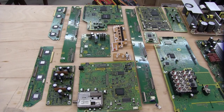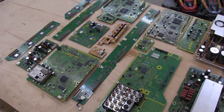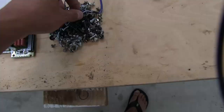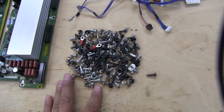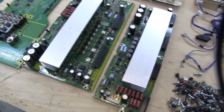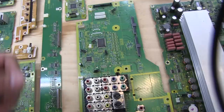I tried to get a good close-up of the edge of that small broken piece of panel. The top layer of glass is the rear of the display and the piece on the bottom is the front. You can see that small thin layer right in the middle — that is the phosphor cells, sandwiched between those two plates. Just because of how close-up everything is, those two layers of glass look super thick compared to that really thin phosphor layer in the middle. And we're pretty much done — these are all the boards that were inside this thing, a lot more than I was expecting. This was a pretty packed TV and I can't imagine it was cheap when manufactured. Here's all the cabling, ribbons, and most of the screws. Hope that was kind of interesting — thank you all for watching and I'll see you guys around the bench.